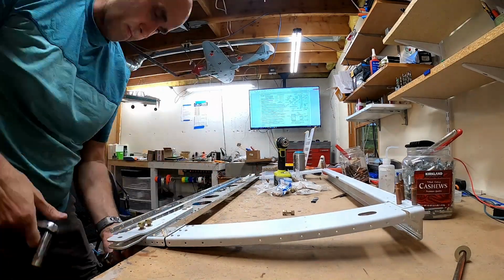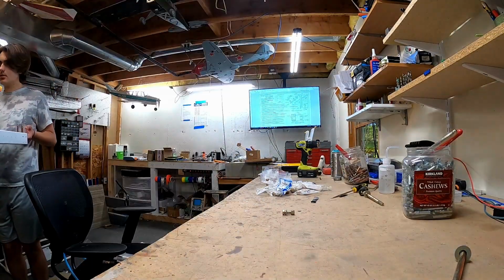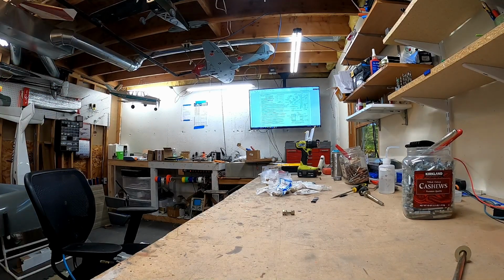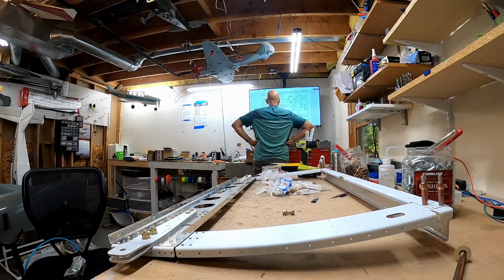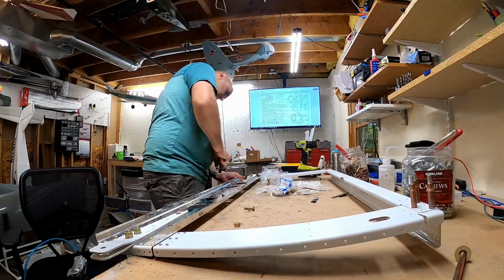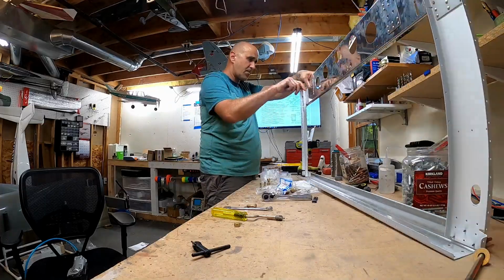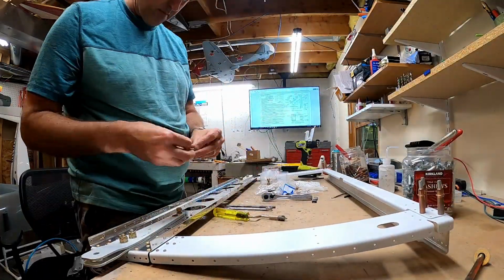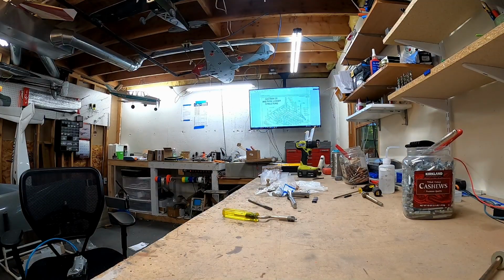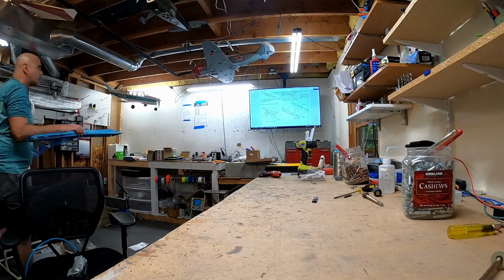Those look like AN5, not AN6. And then having my son help hold it, as you see there, and using the wing attach brackets as the guide. So I've got 2 bolts in. It's possible the other ones are going to move. And then you just sort of ream through the new ones and through the existing part into the new part, and then go from there.